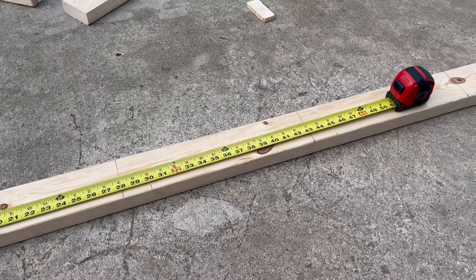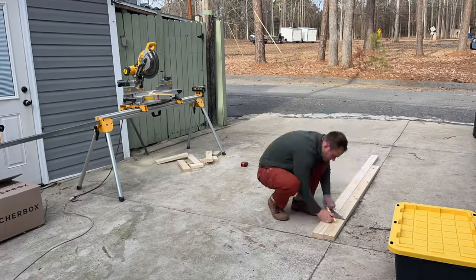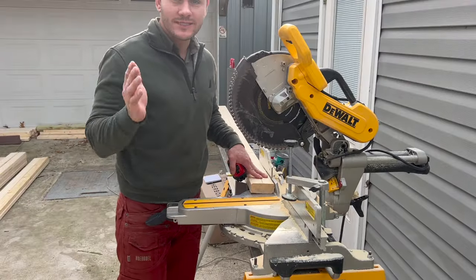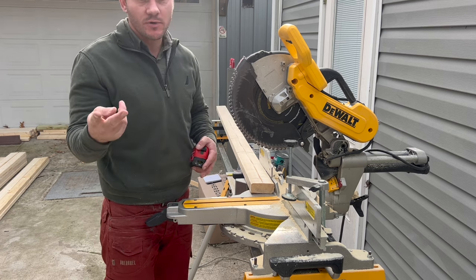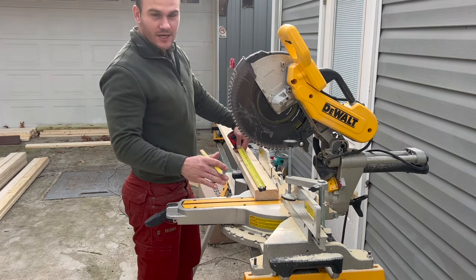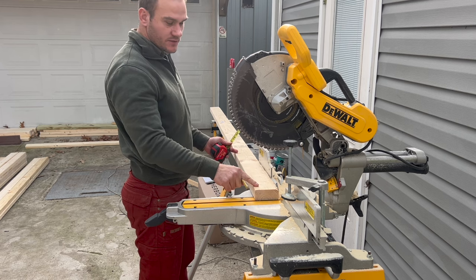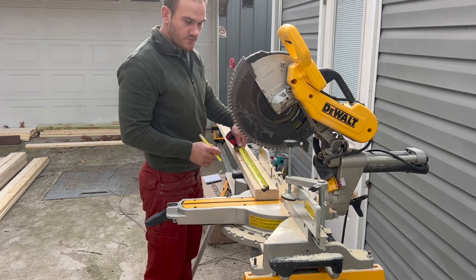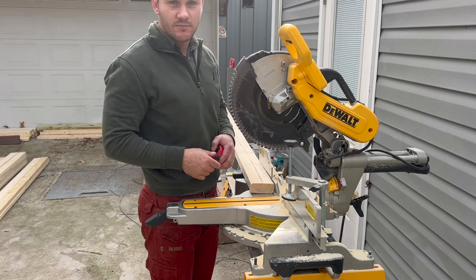Now I'm going to cut all the sliders. To calculate how many sliders you need — that's where your lids or boxes slide on — it's two per box. If you have 20 boxes you need 40 pieces. I'm cutting them at 31 inches because at 32 inches I'd be just short of getting three full pieces out of a 96-inch board after trimming edges square. At 31 inches I get three pieces out of one eight-foot two-by-four. I'm doing five by five — 25 boxes — so I need to cut 50 pieces.